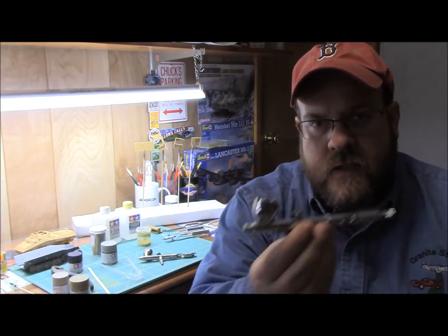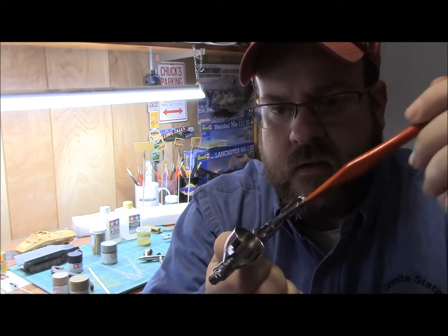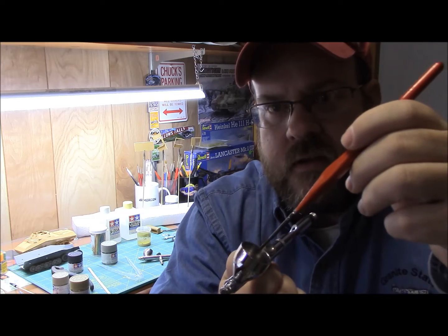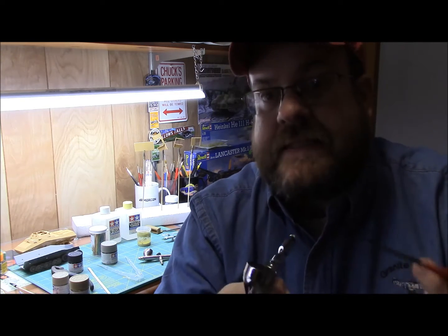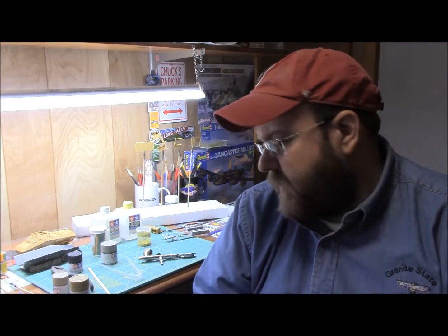So what I do like is I'll just do a paint test. Here's my paint cup, and when my paint and my thinner's in there, I'm stirring it. And what I'll do is I'll just take my paintbrush and I'll just put some up against the wall, and I'll draw it back. And I'm just going to look for, does the paint stay on the wall, or does the paint run back down? And what I have found is that if it's running back down and it's not sticking to the wall, we're in a good spot. And as you're painting, you do your practice brush strokes. You'll see where you're at and you can adjust it. But generally, I've been very successful with that technique. And again, as you get more comfortable with painting, you're going to find variances of where it works comfortable for you, and that's kind of like how it is. Alright, so that's that part.